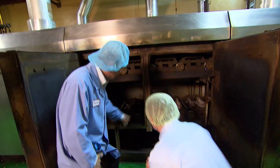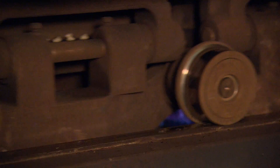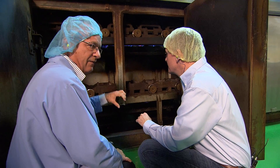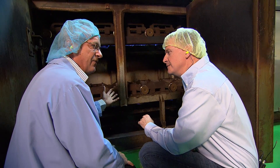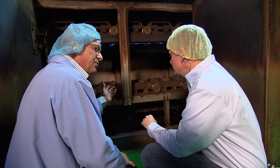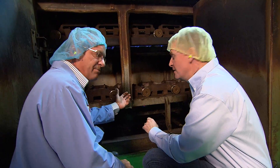You can see these are the bearings. These bearings don't require any grease — they're all graphite impregnated bearings with housings inside. On our other ovens, we need to lubricate these three to four times a year. And there are approximately 1,000 bearings in each one of our ovens. 1,000 bearings.